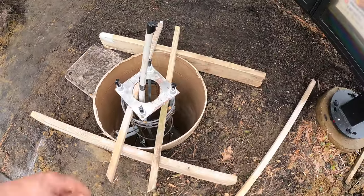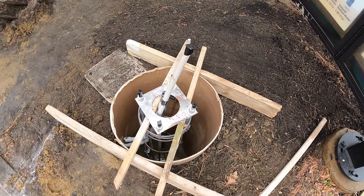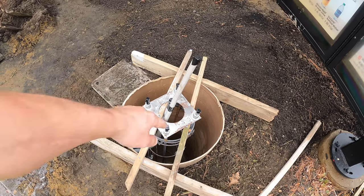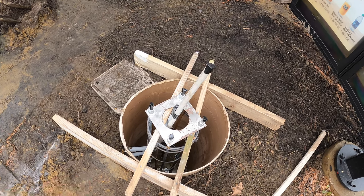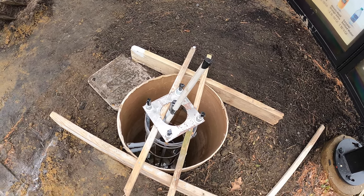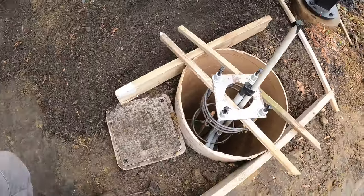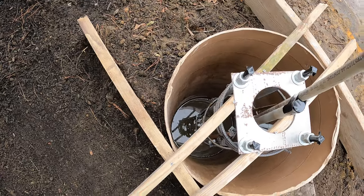And so what happened was, as we're augering down, the sides were collapsing in. So we ended up taking a sonotube, driving it all the way down to the bottom, and then we had to use post hole diggers to just do the last foot and a half. It wasn't fun, but we got it. We had our inspection yesterday. He was happy with everything.